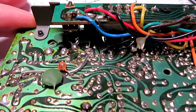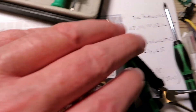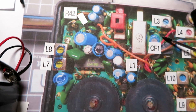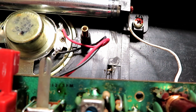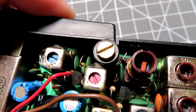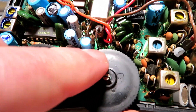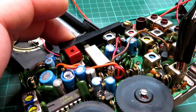This is the first time I've seen a double-stacked board like this in this kind of arrangement. I spent some time printing off a picture of the radio and going through highlighting all of the inductors and components. In the brochure that comes with this walkie-talkie this is evident, but I didn't have it at the time of this repair. One thing to mention when you do these repairs: always check those leads. If the boards have been out and anyone's messed around with them, those wires very often go down to the last strand. Always cut them, strip them, and remake all the speaker wires, power wires, and antenna wires.